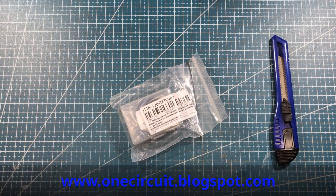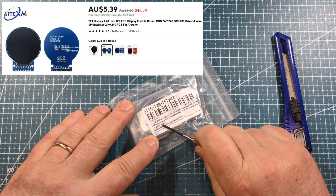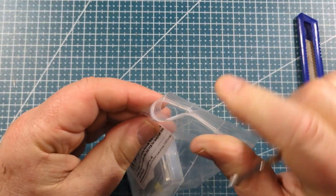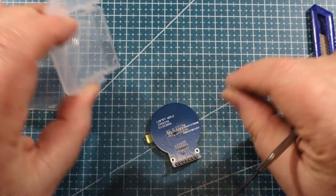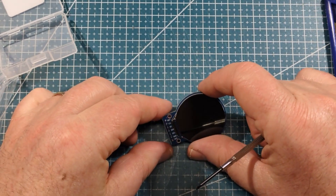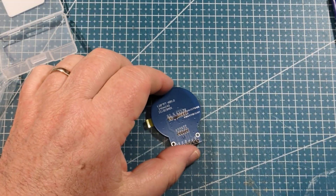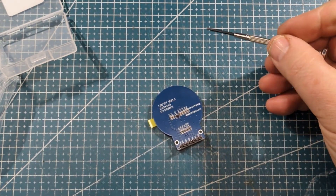This next package piggybacks nicely on the last one — it's a TFT display. 1.28-inch TFT LCD display module board. This is the thing I was talking about that might replace the clock, only because it is round. Opening it up — that is the display. Pretty nifty. The pins are: RST, CS, DC, SDA, SCL, ground, and VCC. A little bit of exploring about how to talk to it, and I'm assuming there's code out there since it's been around a bit. Lots of frustrated people trying to talk to it on the internet, so it could be an interesting one.